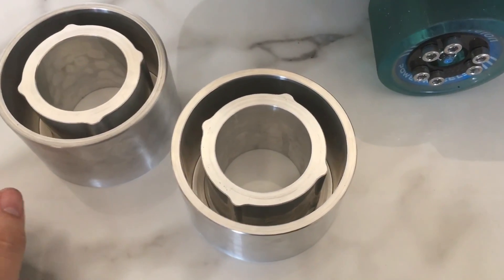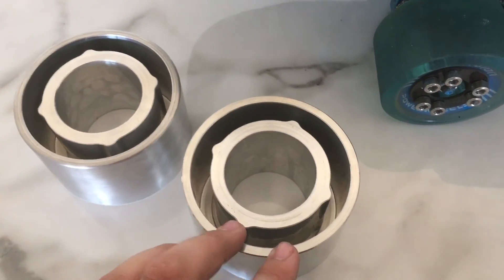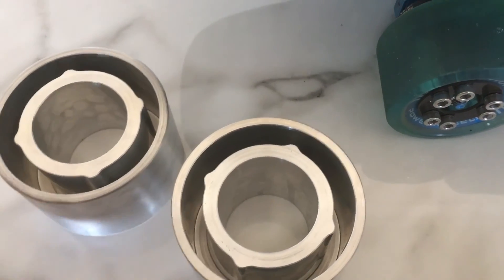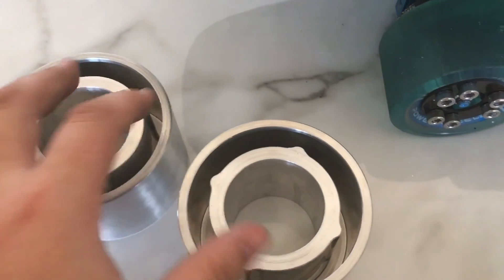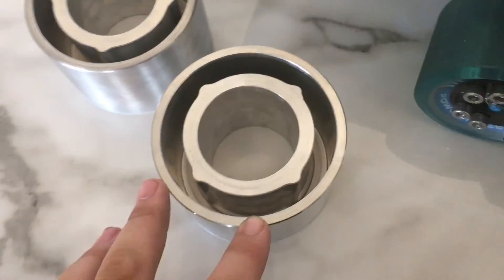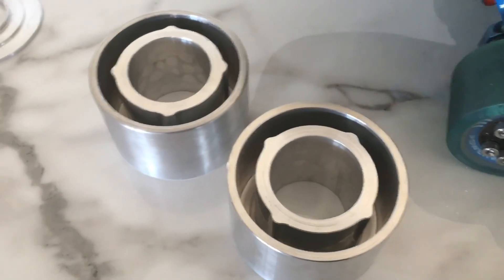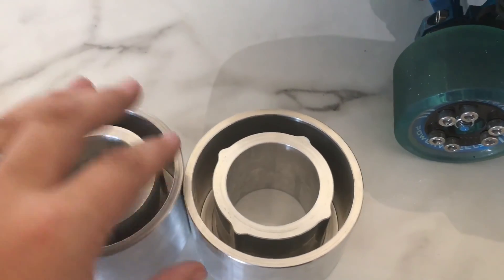The other reason I use aluminum is because I can have five molds instead of a hundred, and in a day I could make a hundred wheels from just five molds — because curing time is half an hour. If I had a cold pour urethane it would take 24 hours for curing time. Thanks for watching, and for everyone who's ordered my motors, I hope you really enjoy them.